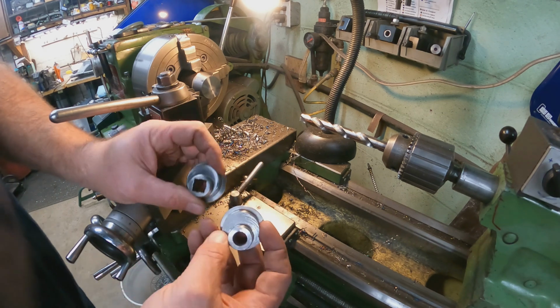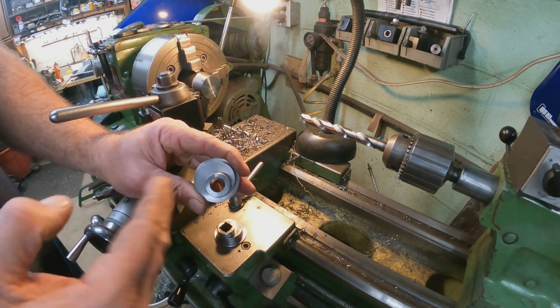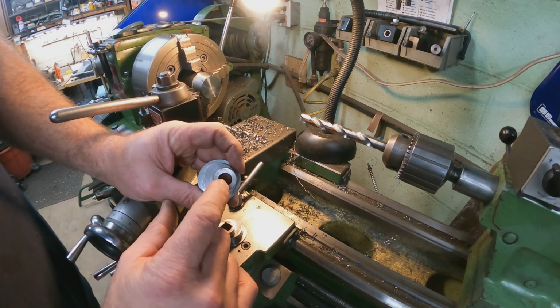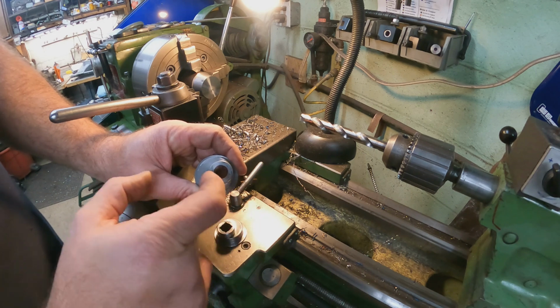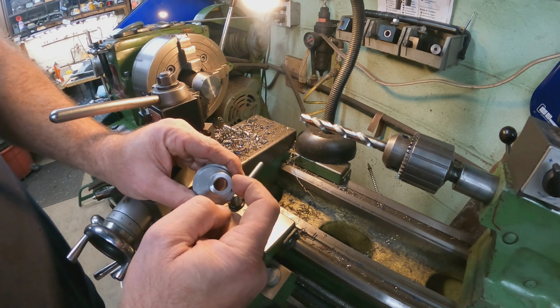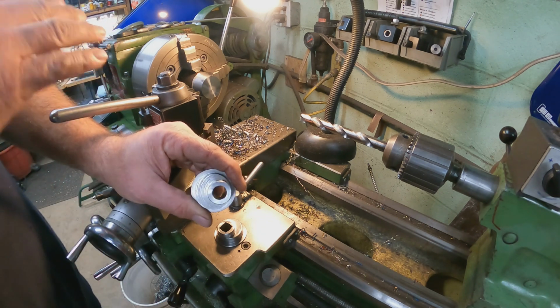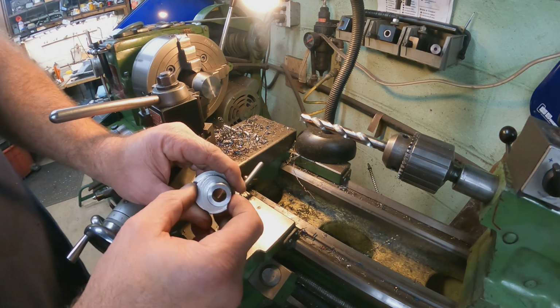But whenever I was cutting this, you guys might have noticed whenever I was setting the 0.25 offset, what I was getting to is it's 0.25 from center of the hole to the center of this. So whenever you check that, it's actually a 1/2 inch from here to here offset. So that's why you've actually seen a 1/2 inch, but really it is only a 1/4 inch offset, but you know, just the way it is.